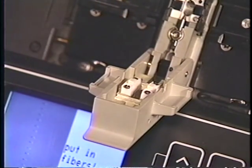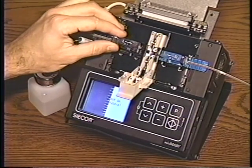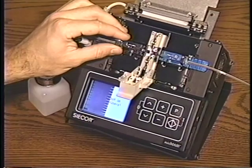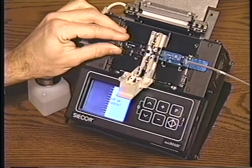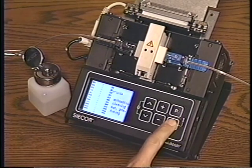If this doesn't work, soak one of the cleaved ribbons in alcohol and use it like a comb to sweep out the groove. This may damage the ends, so you may need to repeat the cleave step. Allow any alcohol to evaporate before fusing.